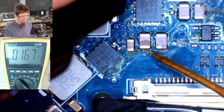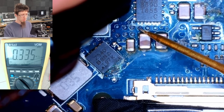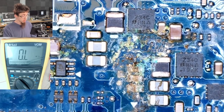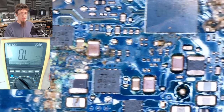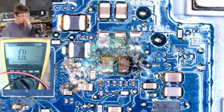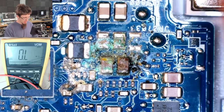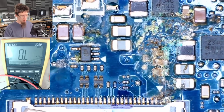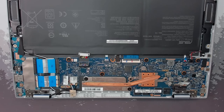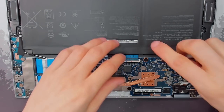Let's just go onto the back of these capacitors. There is a bit of conformal coating as there tends to be with motherboards. That's not shorted; the other side will probably be ground. All of these areas here look really upset and angry but there's no short circuits there. That doesn't mean there's no problem, but it's certainly a good sign. If we travel up here, we do have a short circuit in this area, so maybe there's a good chance that if we clear that short circuit we'll actually be okay. What I might do is clear that and see if it switches on. Let's get the motherboard out of this thing.